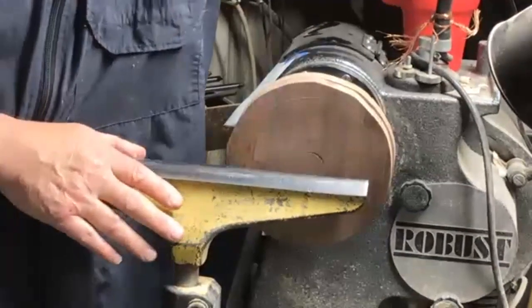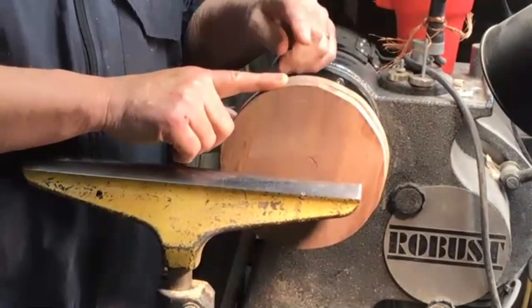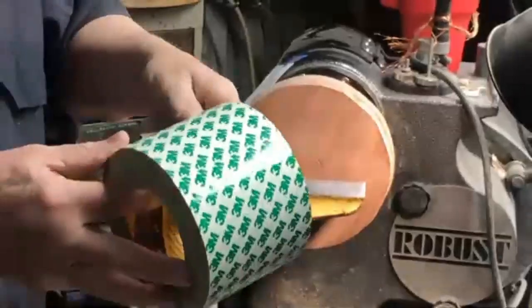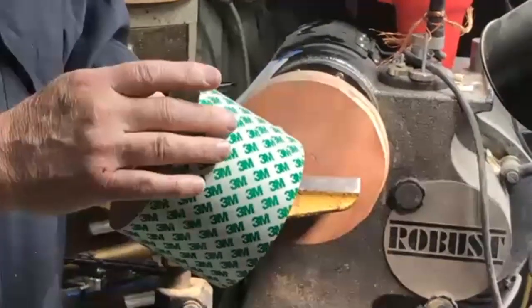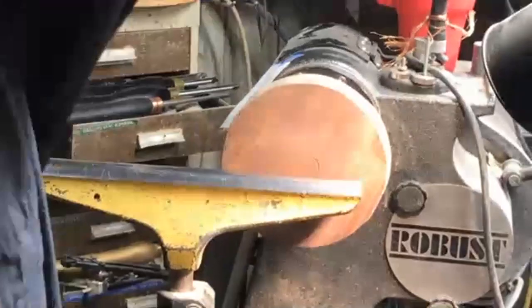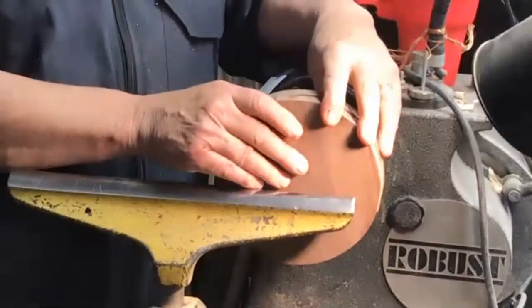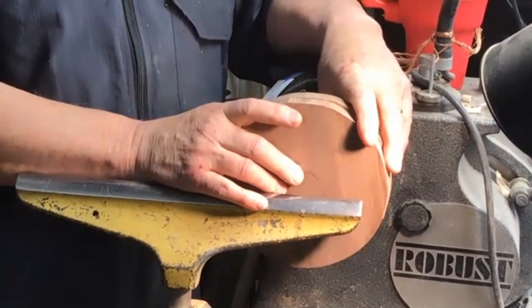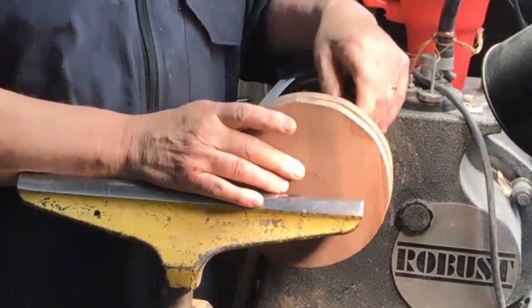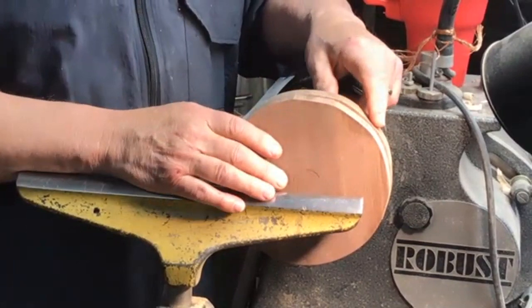There are actually two pieces of walnut here and we use that same double-face tape that we used on the stand. Get some good quality double-face carpet tape and that'll work fine. When you put these two pieces of wood together, clamp them, and when you put it to the face plate use a couple of C-clamps - the strongest grip you can get. Squeeze that adhesive against the face plate and make sure your face plate is clean and your board is flat.